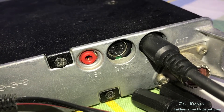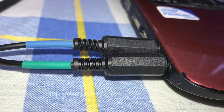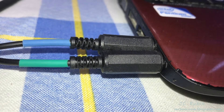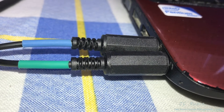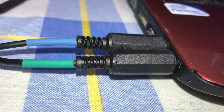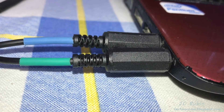You can see on the back of the unit is the data jack, and that's the jack we're going to use to connect this cable to. The other side of the cable is going to connect to the laptop or computer. Most of them have a microphone and a headphone jack. If they're not labeled like mine are, you've got a 50-50 shot of getting it in correctly. You're going to find out during troubleshooting if it's in backwards or not.